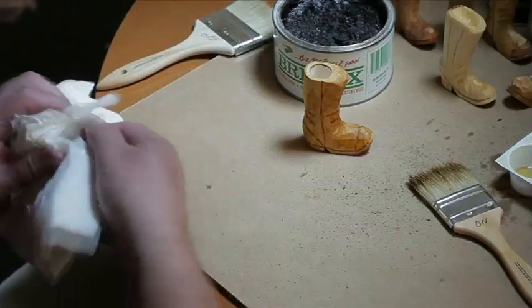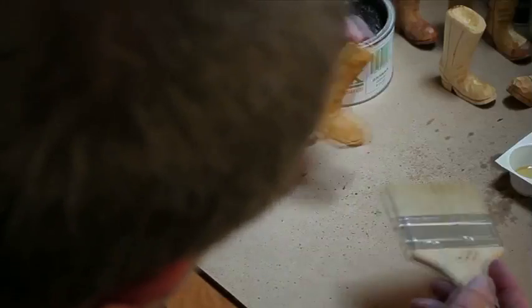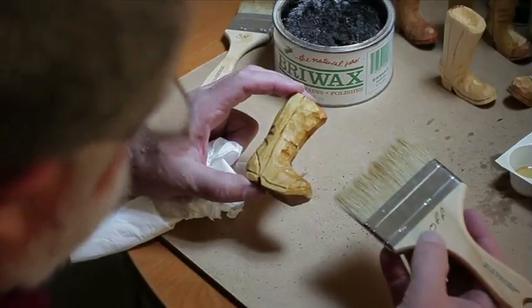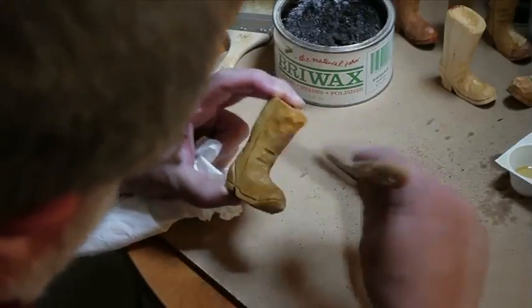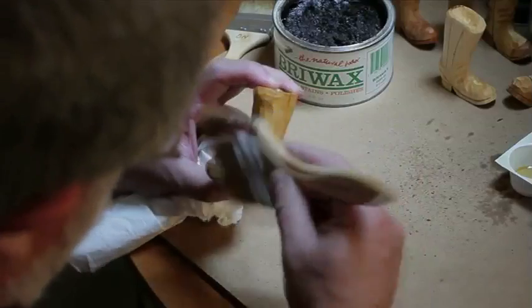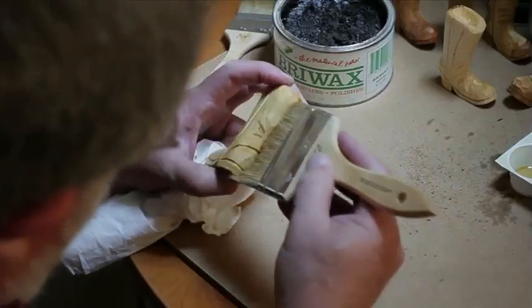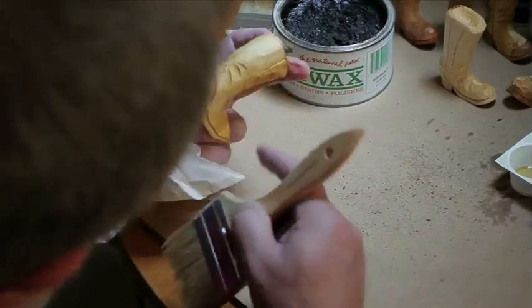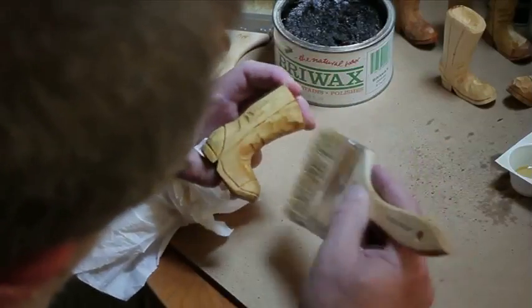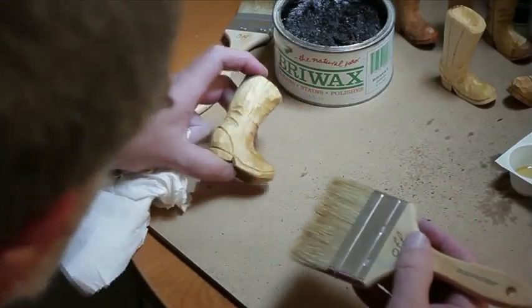With the wax, after it dries, you can take another brush. I know people that use shoe polish, but you want a brush that you take off and just brush off that excess. I always let it dry even a little bit more, and then wipe it with a paper towel. You come out with a nice looking finish, and you can see how the accent marks in the wood grain stand out even a little more. The nice thing about a brush is you can get it down through the grooves.